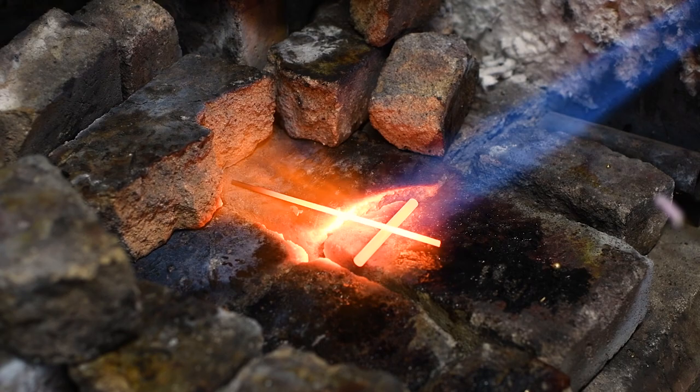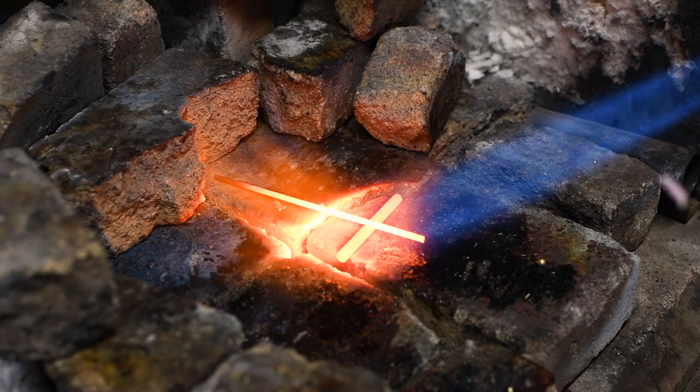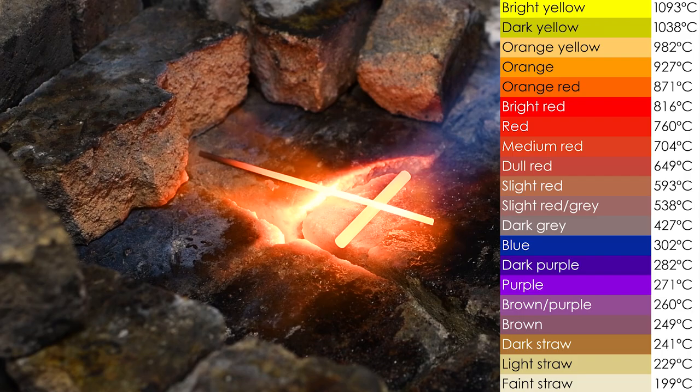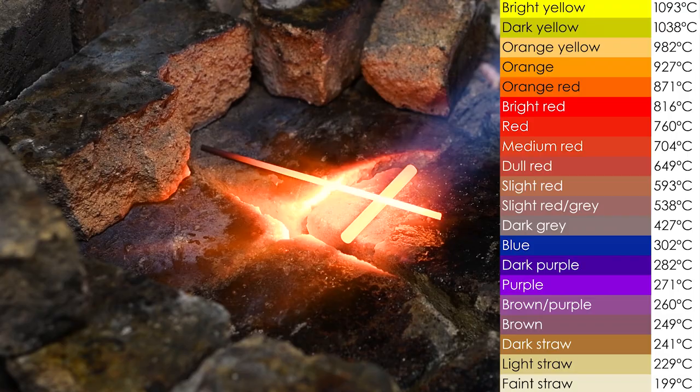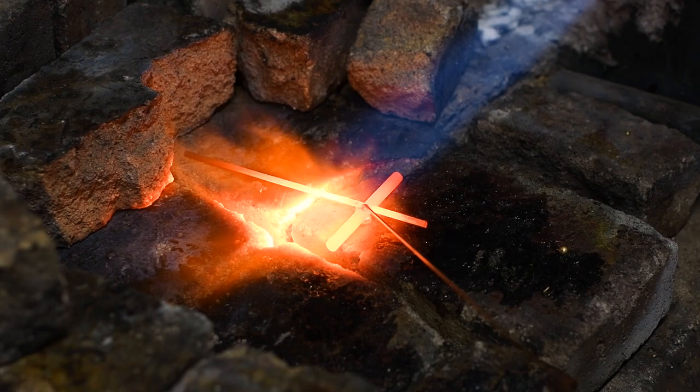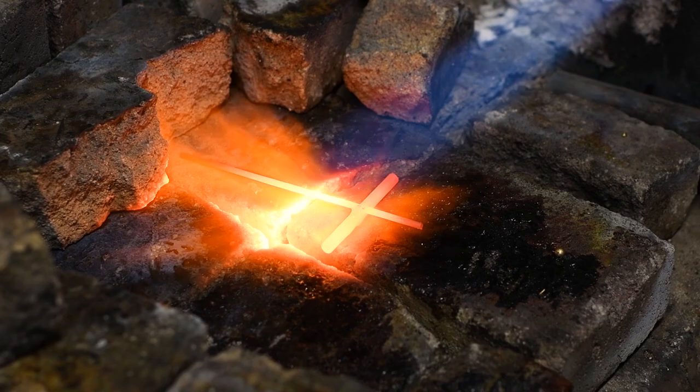We are looking for a temperature in the region of 850 to 900 degrees centigrade, and we can tell that by the colour the steel has gone to. As it heats, it changes colour through a series of purples and blues, reds, and through to the oranges. Using a colour chart, we can work out exactly the temperature the piece of metal is at. When both pieces are at the right temperature, the end of the brazing rod is placed on the join. The flux melts away, the brazing rod melts and flows around the join, and when you are happy that the join is correct, the flame is turned off and the brazing rod solidifies.